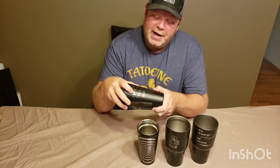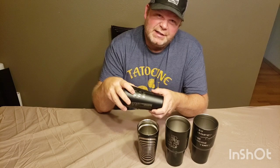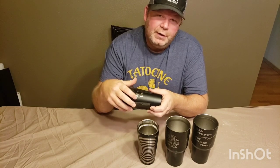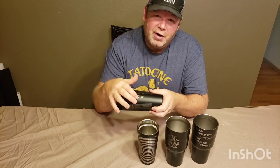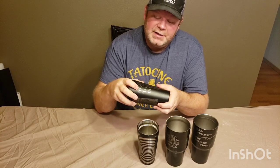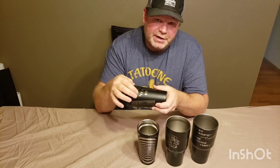And kind of played with the line spacings. I ended up staying with like a 0.08 millimeter or 318 DPI. That's as high as I like to go. You can see all these different squares. And I just kept stepping up the speed higher and higher and seeing how much it took to scrub the soot off. Now at these low speeds, where everybody else is typically running, it has really heavy soot after you get done burning. You've got to take some cleaner, a magic eraser, and give it a good hard scrubbing to get that soot off.